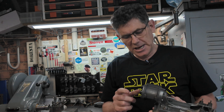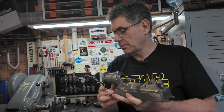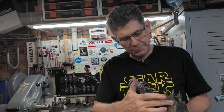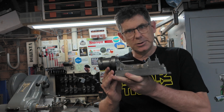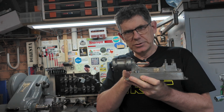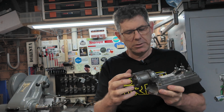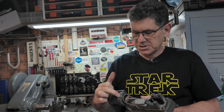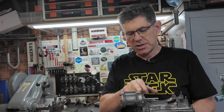Alright, so we got there in the end and we've made our end caps for our cylinder. I've gone ahead and bolted everything up so you can see where we are - we've got the cylinders now mounted on the bed and I've put the bed onto the base. Starting to look like an engine, which is getting very exciting. It looks like we're very parallel with this cylinder rod. I still haven't done the piston yet. The end caps look really good - they're really parallel, it's coming up really well. I did leave these end caps oversized, but based on the plan they're supposed to be the same size as this flange, and I think I'll leave them that way because I can paint up to that edge and it'll be a nice break.